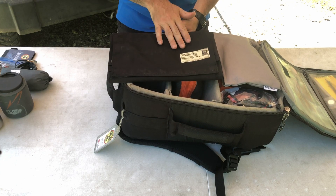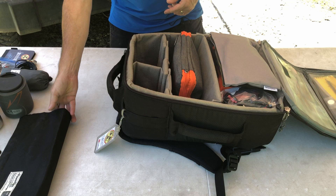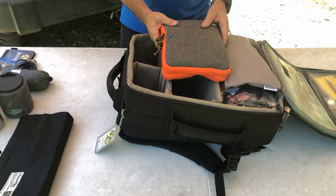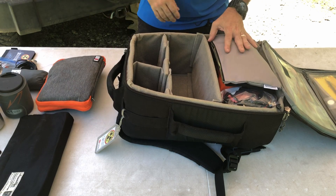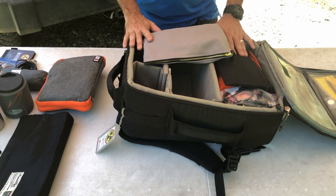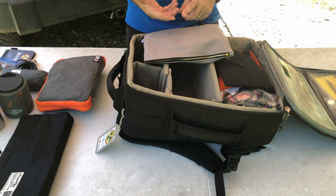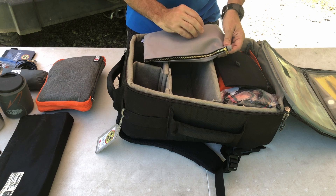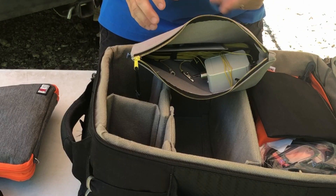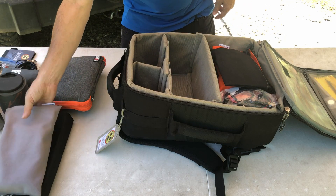Next up we've got the PowerFilm 30-watt solar panel, and this will be my primary solar panel for Field Day this year. Now I typically keep two different antennas in this bag, and I haven't decided which HF antenna to use this year. I've got basically three choices. This bag houses an end-fed half wave — a homebrew with a 49-to-1 transformer. That's one option in addition to the IMD-109 by TN-07, which is not in the bag today.